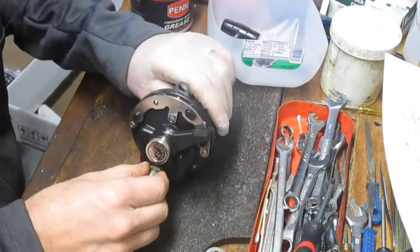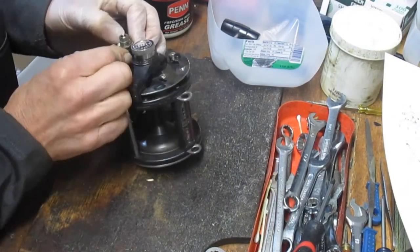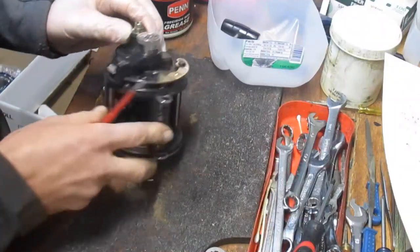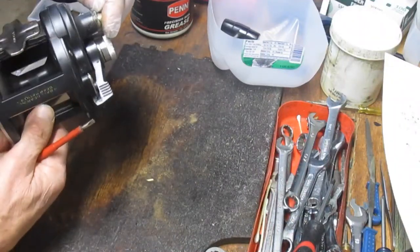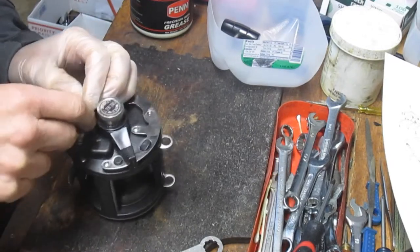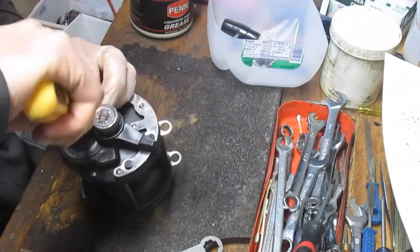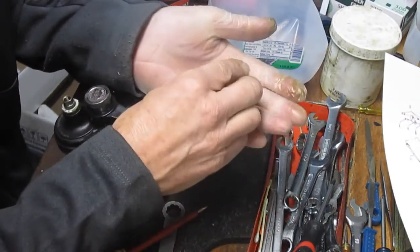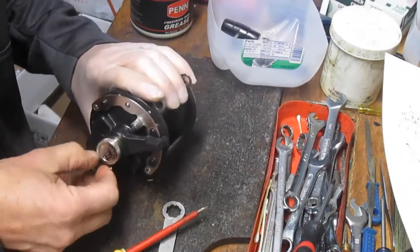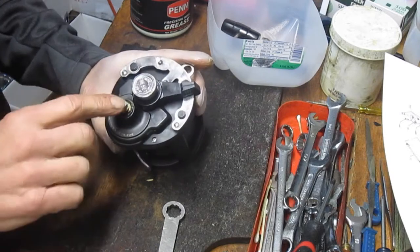I just took the collar off, and there should be a C-clip underneath that. There's a little bit of dirt and corrosion there. Now if you have C-ring pliers, those are a little bit easier. If not, just hold to one side and apply to the other. It's actually an E-clip, not a C-clip, because there was a little stud in the middle there. Take pictures along the way on these — if you're doing this for the first time, you want to know where the pieces and parts came from.